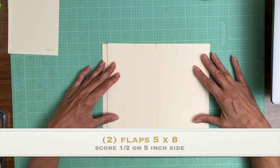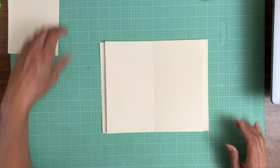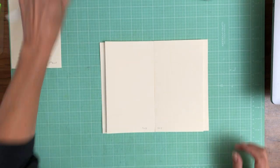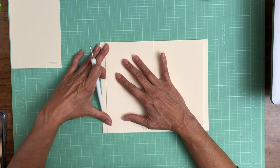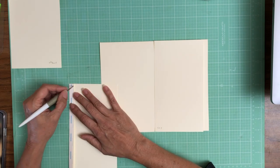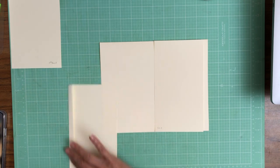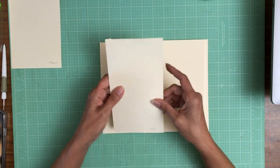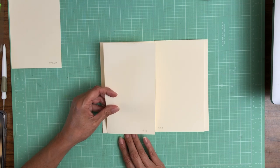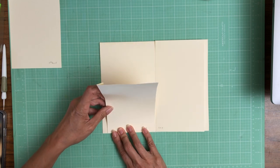So you're going to have a 4½-inch finished panel, and we're going to inset these two panels by a half inch. I'm just using my grid as my mark point for installing these. We're coming in a half inch, so the idea is that these 4½-inch finished panels will meet in the middle. That's the goal. It's okay if there's a slight gap, but I'd like for it to kind of close.